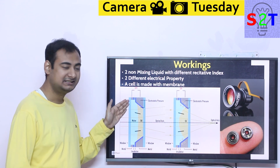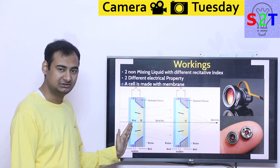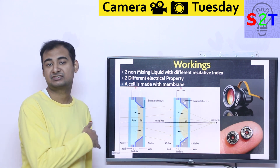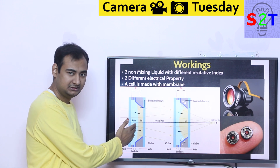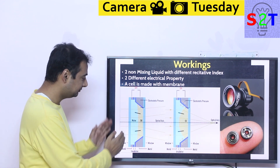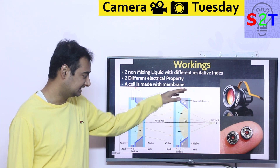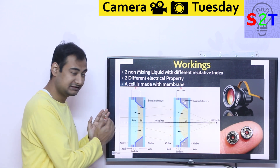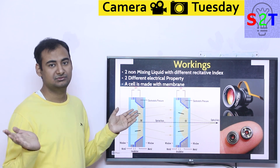People generally start with water and oil for simplified reasons, and there is some truth to it. When you have these two things, you have a boundary — and that boundary is very interesting. It's there because of surface tension and other aspects. You can tune that boundary. If the boundary is straight, you just have a window — nothing fancy. But if you put a concave surface there, it becomes a wide lens. If you put a convex surface there, you get a different focal length. Basically, if you can change the curvature of that surface, you can achieve whatever you want.